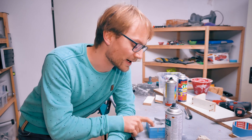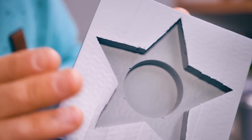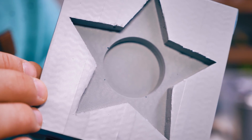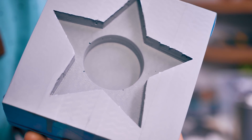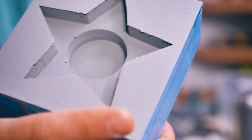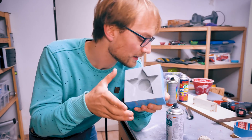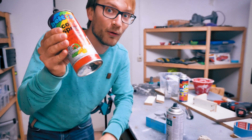As expected, that is really soaking up the primer. I'm gonna give this a few minutes to cure and then put in another layer. I've actually let this dry overnight to give it a really good chance to soak in, and looking at this there's some weird stuff happening. I think something is going on with the plaster reacting with the paint, because in the bottom you can see it's kind of getting a texture - it's almost like it's peeling off. So I think with the big cast I'm actually gonna have to prime the plaster in some way - with wood glue or something - because that should be a very nice and neutral base. But I actually kind of like the look, because it's a nice texture that introduces something that isn't just the pure 3D printed look.